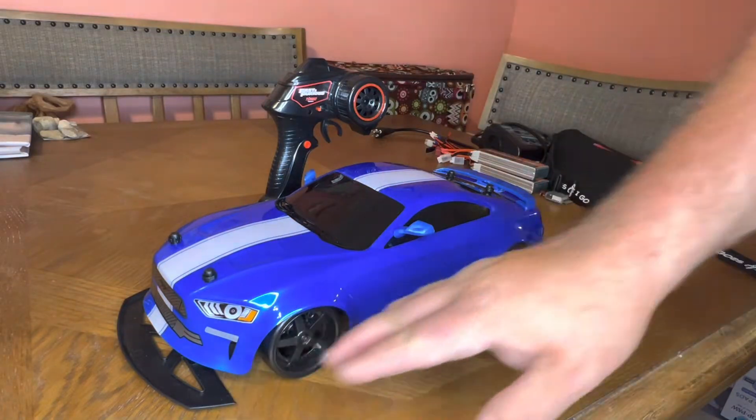Last but not least — this is a hobby-grade charger. You can also go with a $20 version that will charge 3S and 2S, like the Hot RC I gave away with the giveaway. This is a $56 charger, but it'll literally charge every battery under the sun — much higher capacity, larger batteries — and comes with a lipo bag and an adapter to plug it into your car battery. It charges via USB, PC connection, nickel hydride, lithium polymer, lithium iron, lithium ion — it does it all.